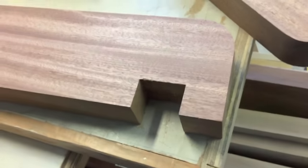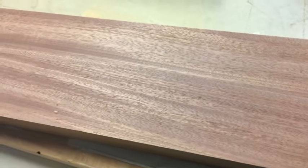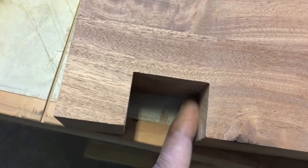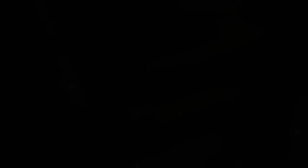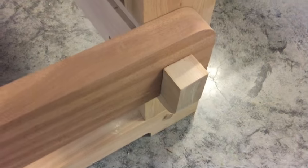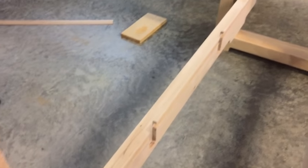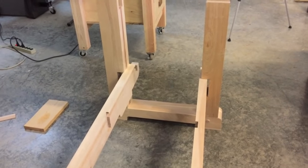In order to get the locking joist to go in, I shaved off one more 32nd of an inch in the surface planer, then ran this edge right up against the bandsaw blade, taking off about a 64th to a 32nd of an inch to widen the space a little bit. After a bit more massaging and removing a tiny bit of material, the locking joist is in place — that will hold the main joists at the proper distance apart. Now I'm going to put in the shelving joist, which should force everything into alignment, and then I can put the shelf in and install the other locking joist.